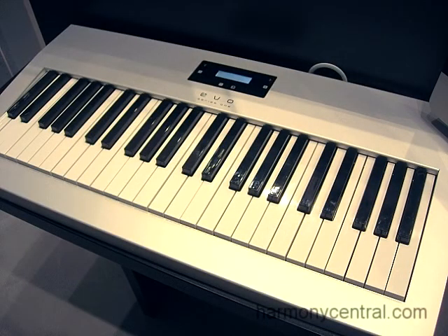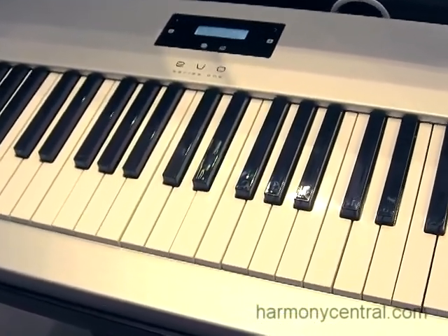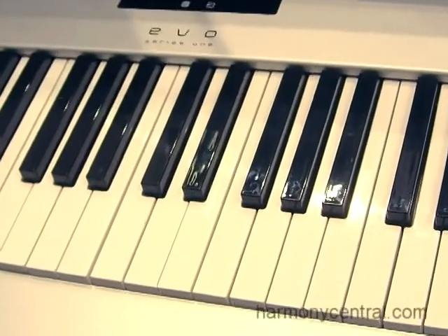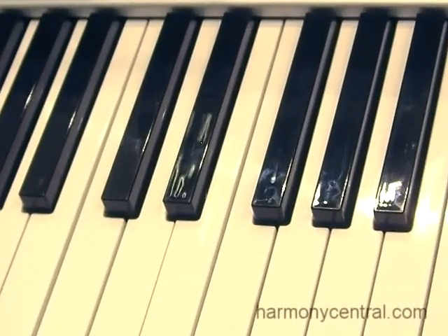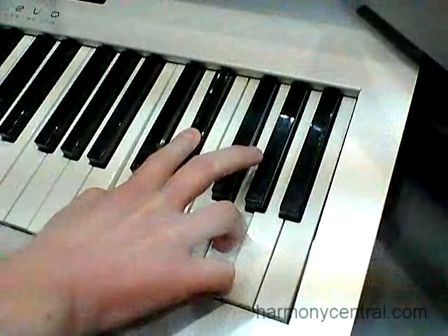That's also the reason for having keys that are a little bit longer and wider. This is because we think it's more of a touch keyboard than a normal keyboard with a touch function. You can make smooth transitions, and you need a little space to move your fingers on. The black keys are also a little bit wider because of the special system we use — it's capacitive touch, and it needs a minimum space to work.